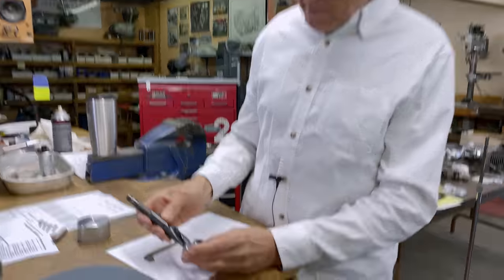The angle of the drill — it's not at a right angle, I'm holding it at an angle. You can see the angle of the drill like that. I'll thin the web — that's just one way of doing it, other people have different ways, but this works for me. Usually when you drill a hole this big you put a center drill in anyway.